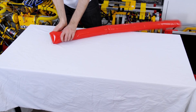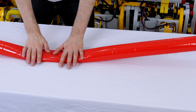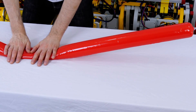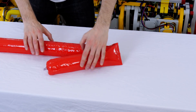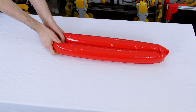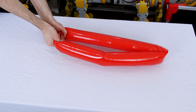In a similar fashion to the Stanford robot, these were inflated once — they contain the air — but if we fold them and squash one end they'll unfold, and that means we can shift air around to create some sort of actuator. I found the best way to do this was to fold them in half and then squash two ends, and that causes the whole structure to straighten.